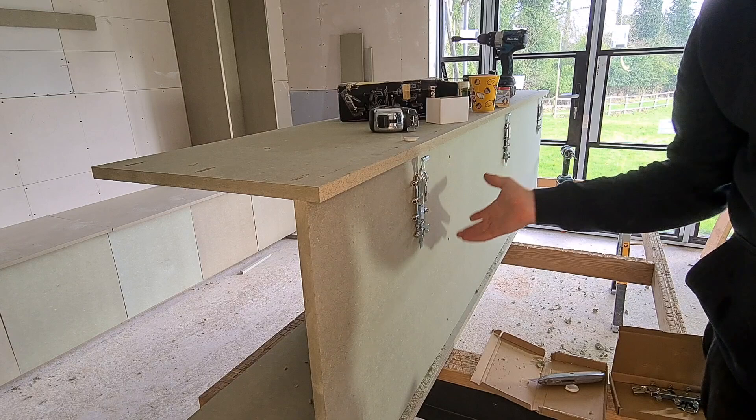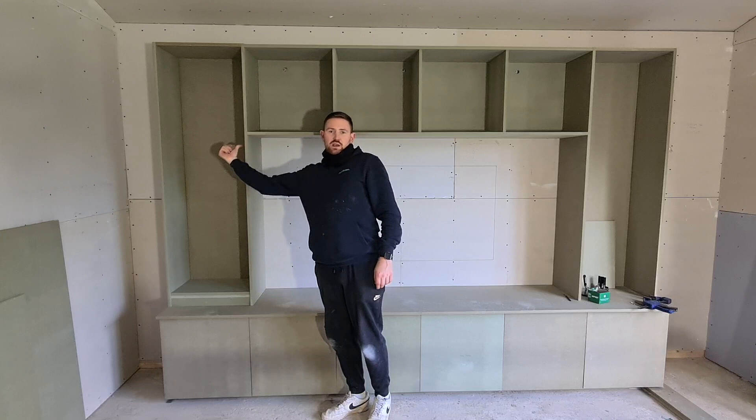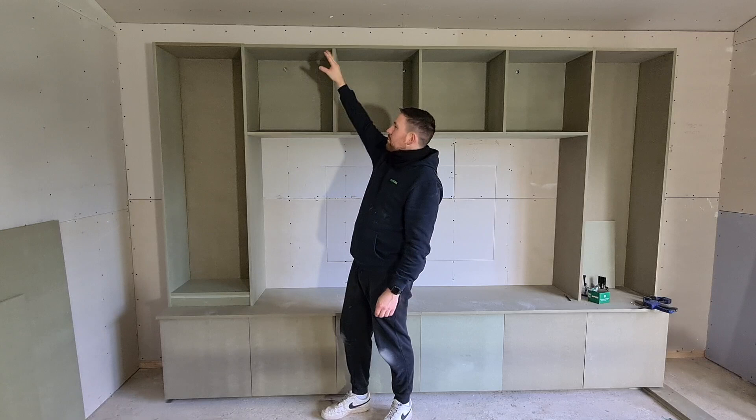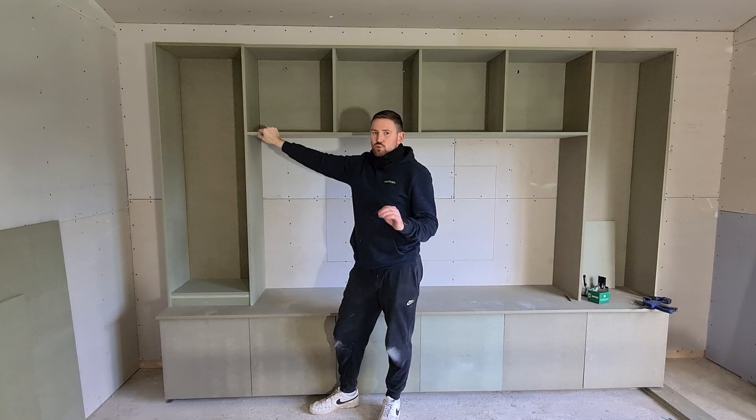So I've got a quick hand just lifting up the wall hung unit. We've screwed that back and I'll just come through the sides from the inside, from the tower unit into the bottom. I'm not going to bother fixing the top yet — we'll do that all on site later. Usually with pocket screws you want to try and avoid tightening them twice, as they get a lot looser fitting on a second time round. So we want to try and only do pocket screws once if you can get away with it.